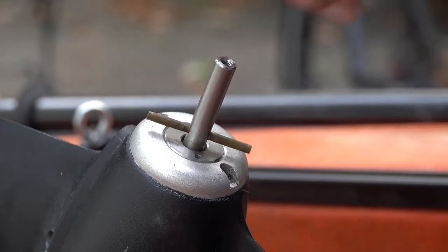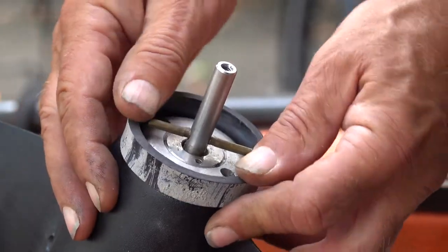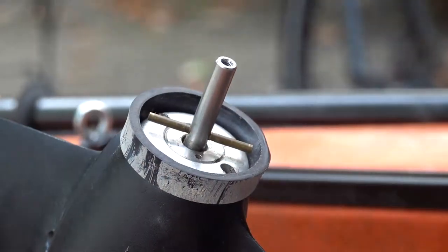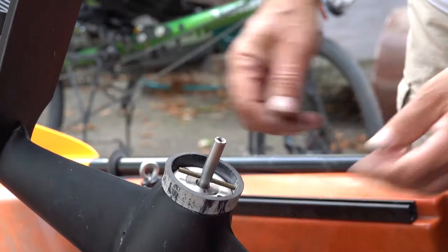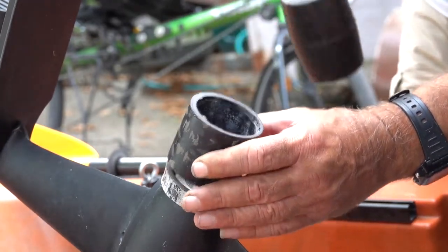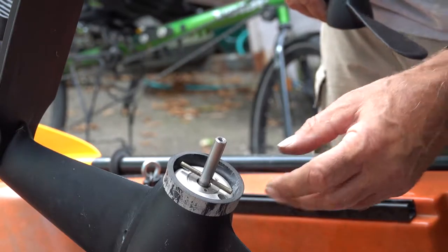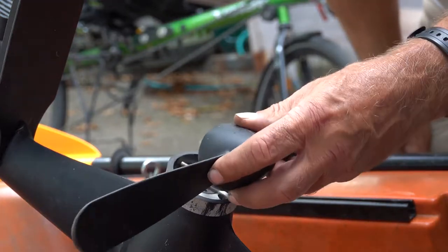Make sure the pin is in place before you put this on. Then you put the ring on and just kind of pop it in place — it should be a very tight fit. If it's loose, that means you stretched it a little bit too much and you might have to make one a little bit smaller. If it's too tight to fit on, just set it in place, get another piece of pipe over it, and whack it with a mallet. Then all you have to do is center the pin and put your prop back on.